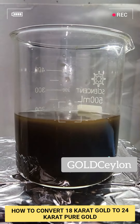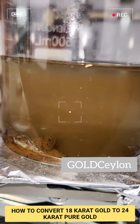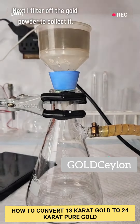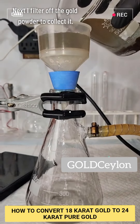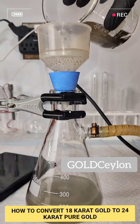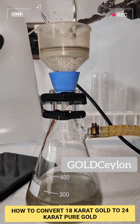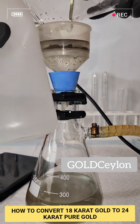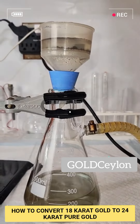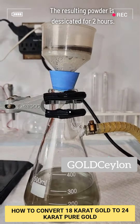And with that, this step is done. I let my beaker sit for an hour to allow my gold to settle to the bottom, which looks kind of like mud. To collect my gold powder, I take my Buchner funnel back out and pass it through, making sure to get every last speck — this stuff is expensive and I don't want any going to waste. The filter paper is then transferred to a vacuum desiccator where it's dried under low heat in a vacuum for about two hours, leaving me with pure, clean, 100% gold powder.